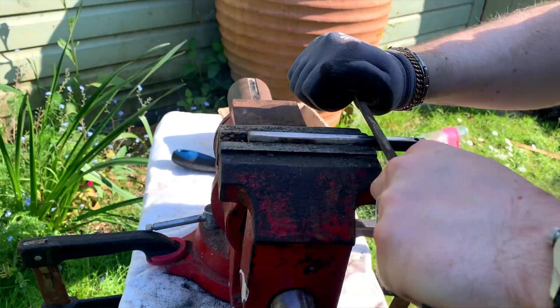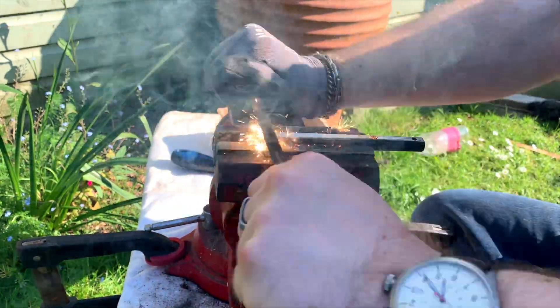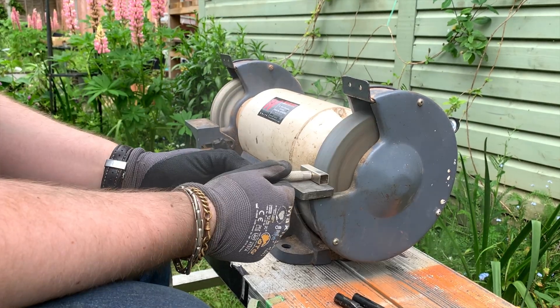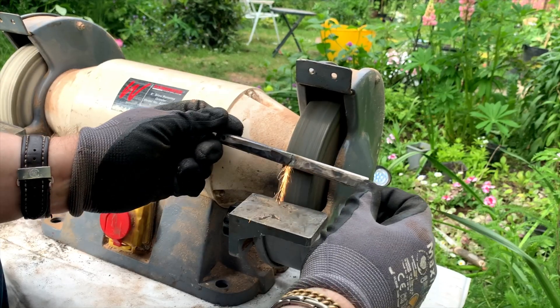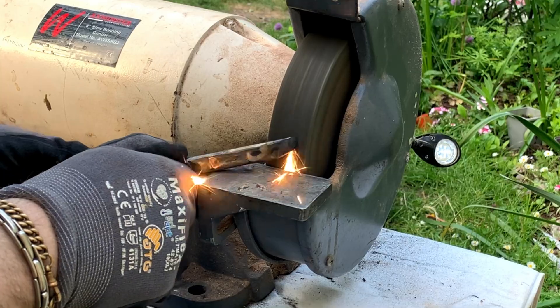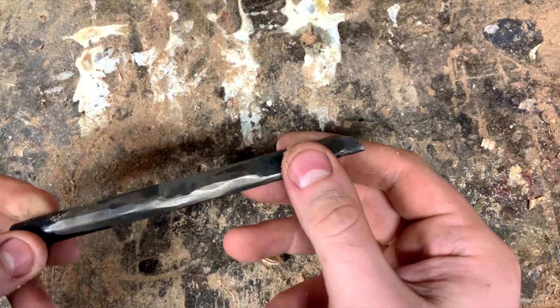In the end I gave up on the oil and just let the sparks fly. It took a lot more sawing and filing to get it somewhat flat, and then I set up my grinding wheel and tried to make it into a rough knife shape. It's not going to be an exact replica of the Wolverine claws because I didn't want to make them sharp or too thin — ferrocerium is quite a brittle alloy. After four hours of cutting, filing, and grinding I finally had one blade done.